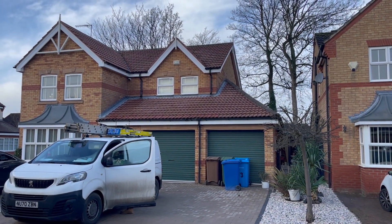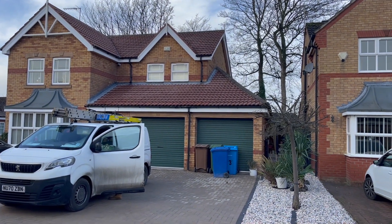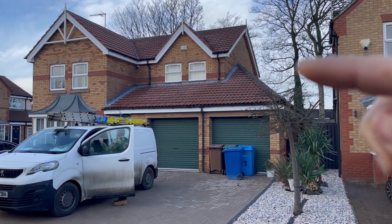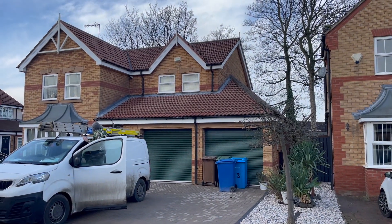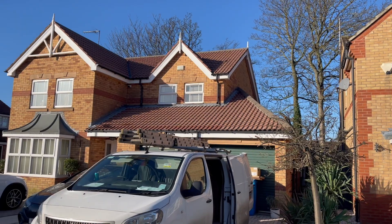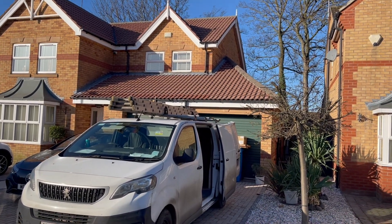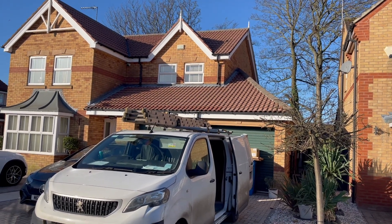It's going to look really nice this one because everything's going to be side-by-side — you're going to have the gateway and your Powerwall, and then hopefully as you can see where the garage is just there. The apex on that, sort of where it meets at the top just up there, it's sort of already in the loft space so if we can drill on a slight angle to get up into the loft we can rig DC cables down. We do have some customers ask us how we can get the cables from A to B — metres in the middle of the house, metres outside the house, solar panels on the roof, detached garage or whatever.